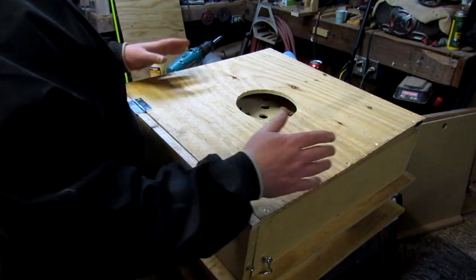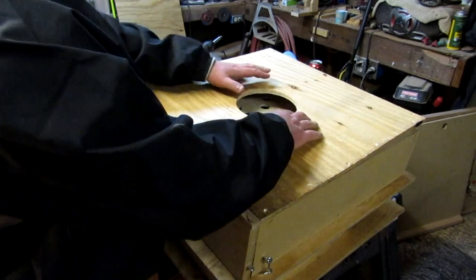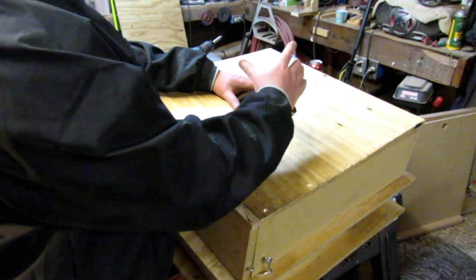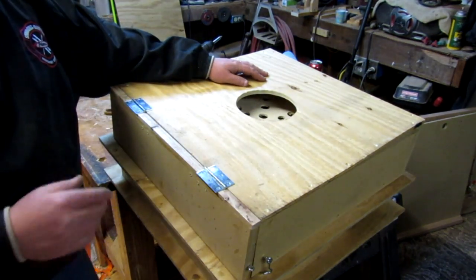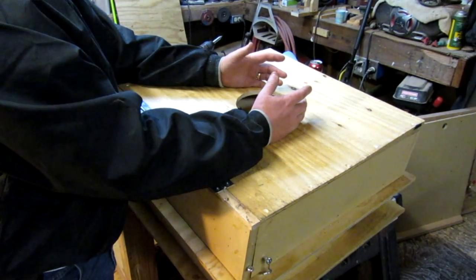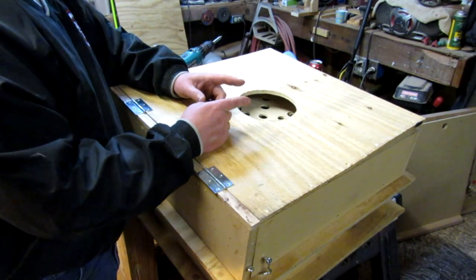So I can take my flange or whatever, and actually this is going to be mounted directly on top of my Cyclone separator. This will actually sit on top of that. I'm not going to have a pipe going into it. Well, yes, I probably will, because I do want to reach down in there a little bit. So I'll make a flange, and I'll probably just turn it on the lathe. It'll be a 4-inch flange, because I have 4-inch pipe, and it'll reduce down from this 6-inch down to a 4-inch, and it'll reach a couple of inches down into the Cyclone.